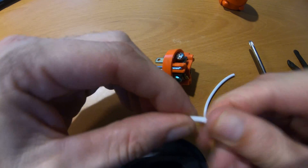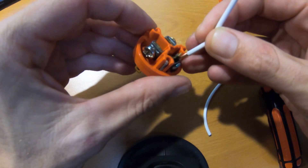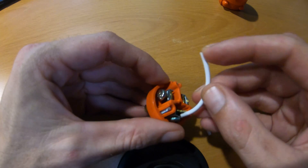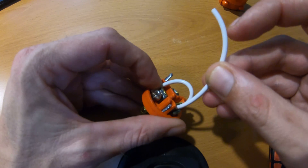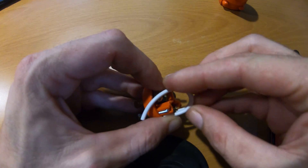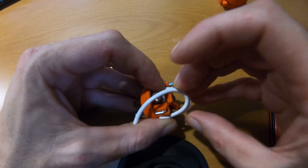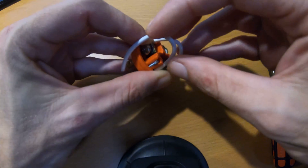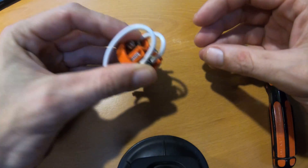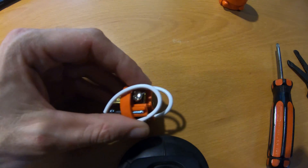I'm going to run two little wires from the ground terminal over to the neutral terminal, and I'll double it up just in case it needs to carry current from 20 amps — because this is only 14-gauge wire and you're supposed to use 12-gauge wire for a 20-amp receptacle. I'll connect these two wires and screw them together. I'll be back to show you the result since it's tricky to film.